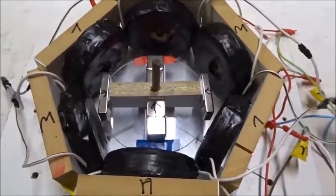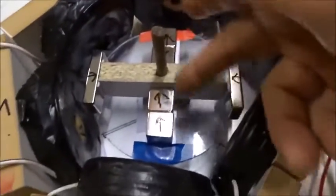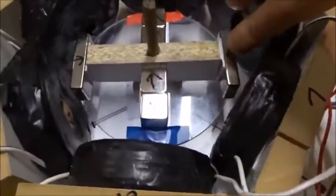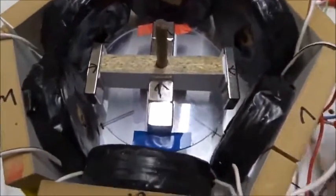Now when we go up to 6 wire coils arranged in a circle, we can still have a bar magnet pointing that way, north pole here and south pole there. But it won't spin by itself, so we have to put 2 helper magnets in, in this case with both poles pointing in. It's wired as UVW, UVW.